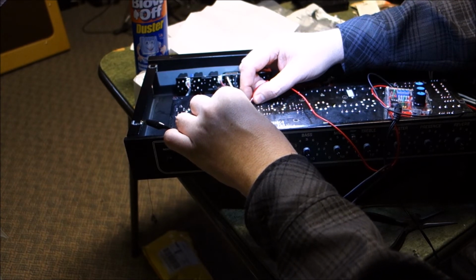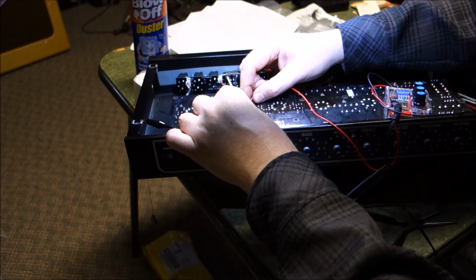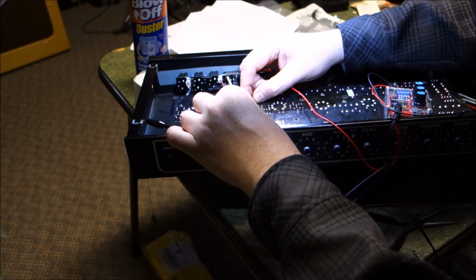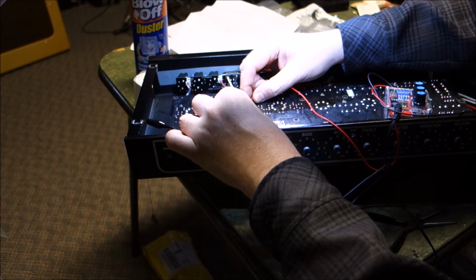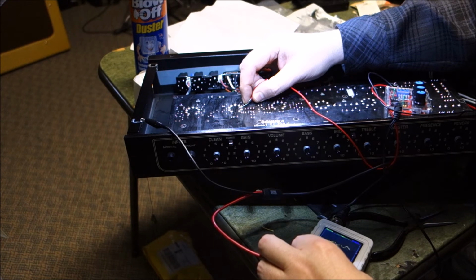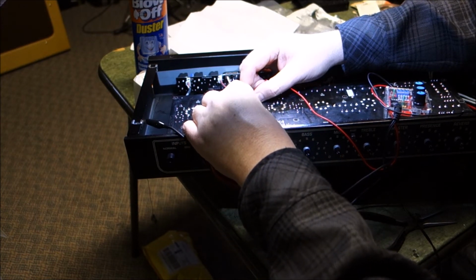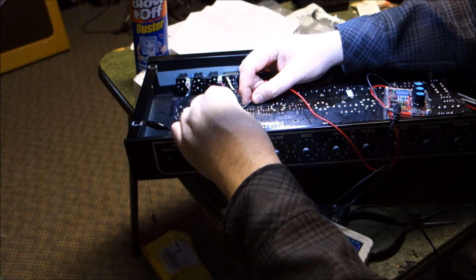On the other side, it's there but reduced. Okay. This is the 470K resistor, and it should appear on the other side but reduced, and I get 0, zilch, nada, nothing. Okay, I got nothing. And let's increase our sensitivity so we can sense all the way down to like 10 millivolts. There's still nothing showing up there.